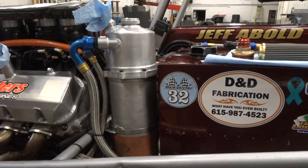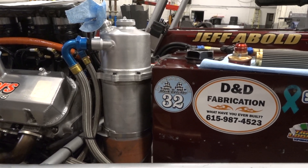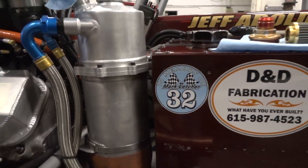For the standard race car with baffles and an oil pan, that's about 6 quarts usually. Most cars that run a wet sump usually run 5 or 6 quarts. You can see the lines here — this is the out, this is what goes out, and this is what comes back in.